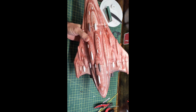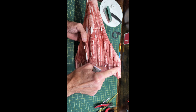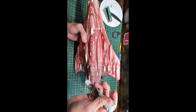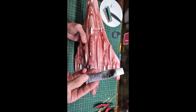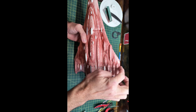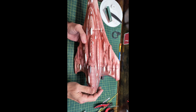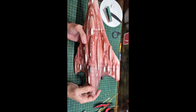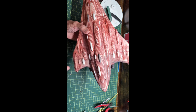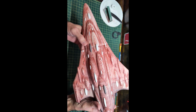I did go in, I had some gaps on the edge, and I think one of the sections lifted up a little bit as it was printing. I should have put a brim around it, but I didn't. I actually used some of this old school Testors contour putty, which actually works pretty good. Filled in the major gaps around the side, a little bit of super glue here and there in different places, and then there's of course a lot of sanding and using my spot putty mixed in with the acetone again to kind of get rid of print lines and smoothing out the process.